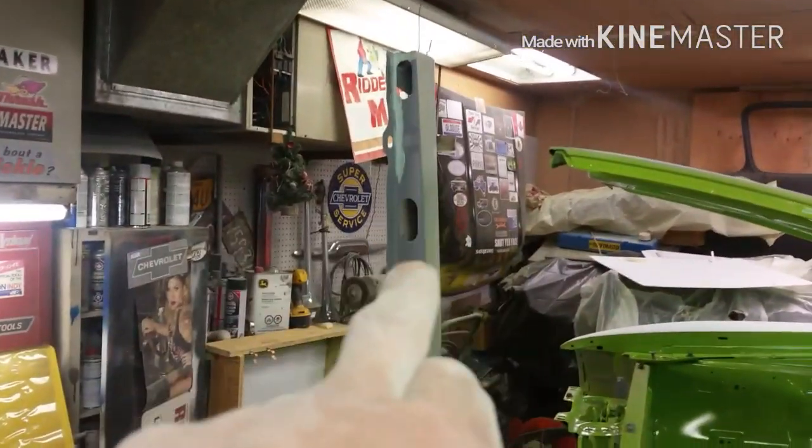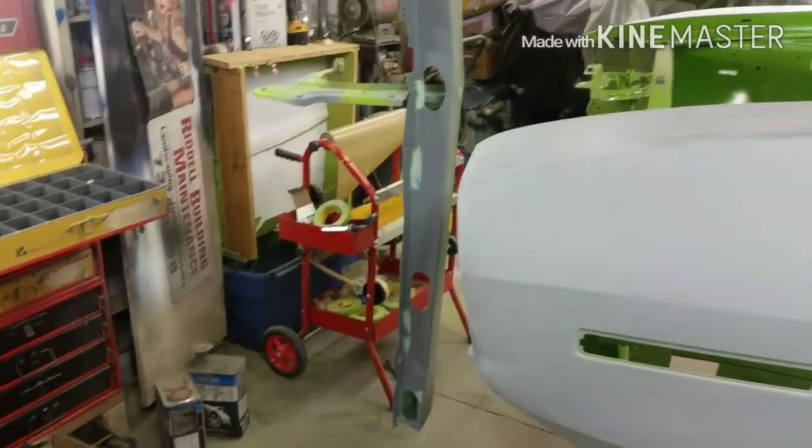Fill them in, sand them down — dries just like Bondo, about the same working time. In the heat it takes a little longer, but it spreads out real smooth and then just glosses over and sinks in nice. Good for filling scratches and chips. I had some little cracks and divots in the corners I couldn't get into, so that spot putty should work out great there. I'll shoot a little primer on those spots, then we're gonna break out the power washer and wash this place.